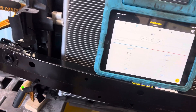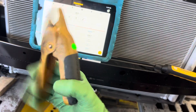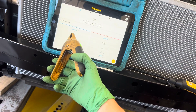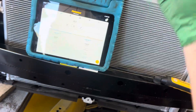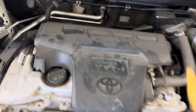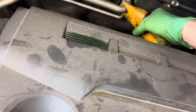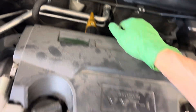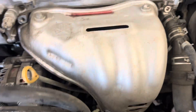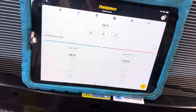We got 33 degrees there. Let's go take a look at what our suction temperature is. We'll take this one off — that's the one that links right there. You'll see it start to drop. We'll go back and see what it is coming out. Let's see what our suction line is — that's a little warm. We're going down to 40 degrees.